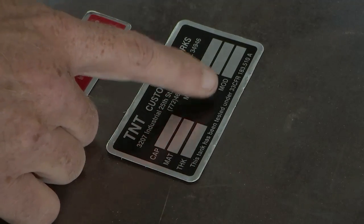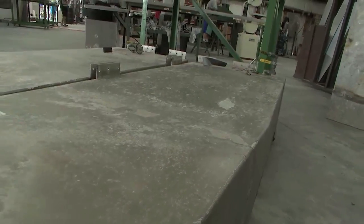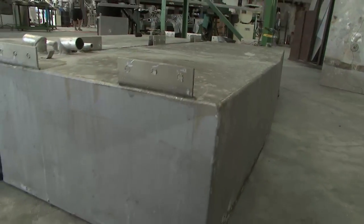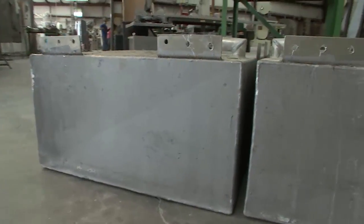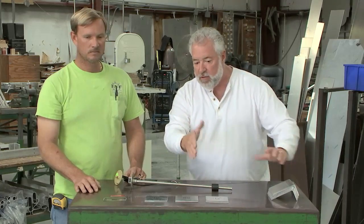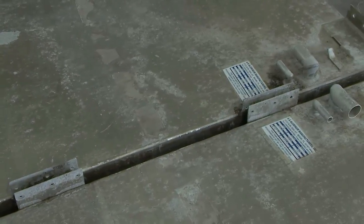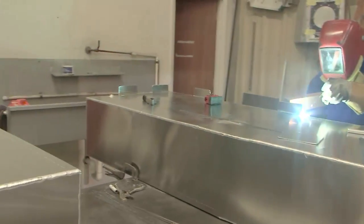Now, we also didn't have a chance to talk about the importance of tabs for mounting a tank. A tank cannot move below deck. And here's what I need you to do on these twin tanks. I need you to put tabs for mounting in the exact spots where they're at, because what Pursuit did in 1989 is kind of in the middle where you see that inch gap. They had some extra componentry that came up through those tabs right to the keel, and they had it supporting the subdeck. But if you could make it like that, that would be fantastic. Yeah, that's not a problem.